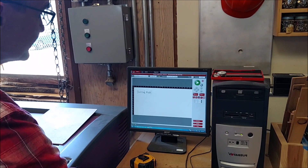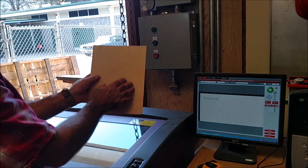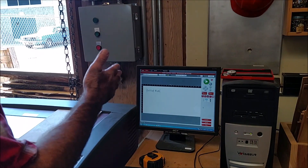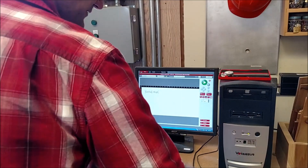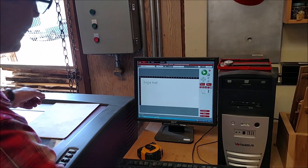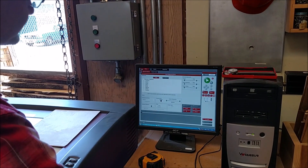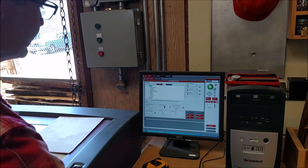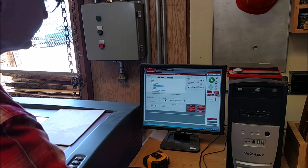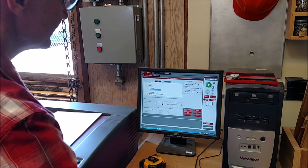I click on the center of my text. I want it a little higher than the middle but centered horizontally, so I click on the middle of my text and put this measurement in at half of 8.5 — so 4.25. Then pretty high up on my board. That looks good. I go over to Settings. It's a natural material, specifically wood. I put it as a general hardwood. The thickness was 0.115 off of the caliper. Apply.